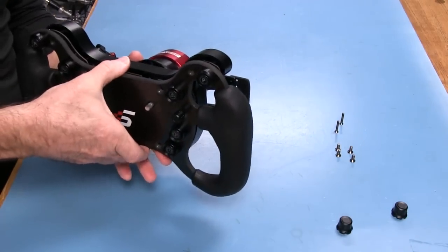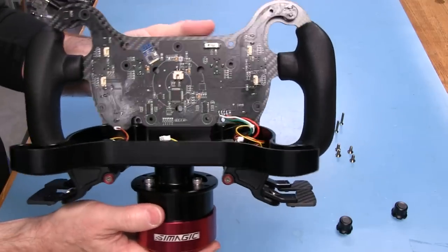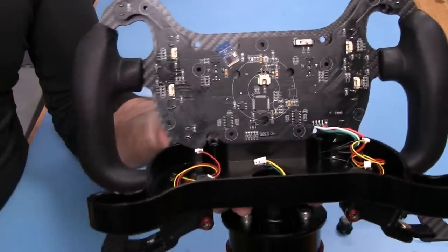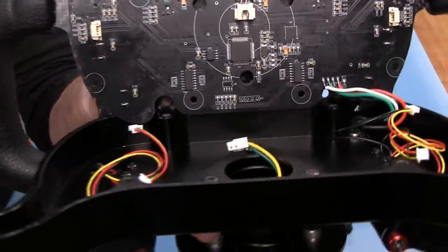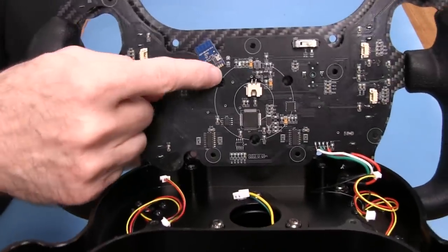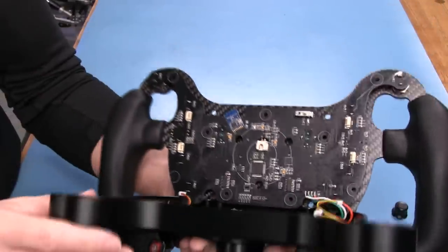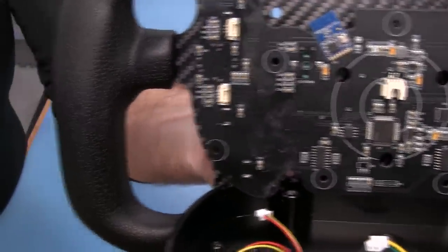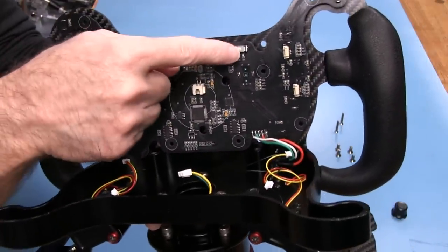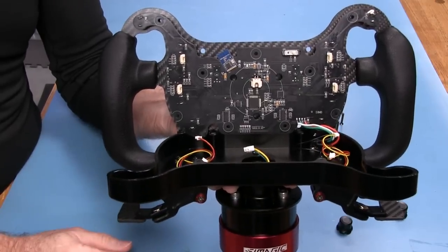Now we're going to spin this around again very carefully so I can show you the circuit board part. Okay, I just don't want to drop this. And there we have a very nice, neat, tidy looking circuit board. The reason I can't obviously separate it is because we have these USB wires over here that are actually soldered to that board. And again, there's the Molex for the center. Here's our wireless connection, or wireless board rather. It looks like it's just stuck on there, but it's not. It's surface or flow soldered onto the circuit board here. And of course, we have our Molex plugs for our clutches and our shifters. They are not marked. I don't see any marking on that for the clutch or the shifter. But when you take them off, you can see that it's easy to put them back on the same way you took them off. Of course, we have our mode selector switch there, and yeah, not much else to see, just a very neat and tidy layout in here, which is what I was expecting.